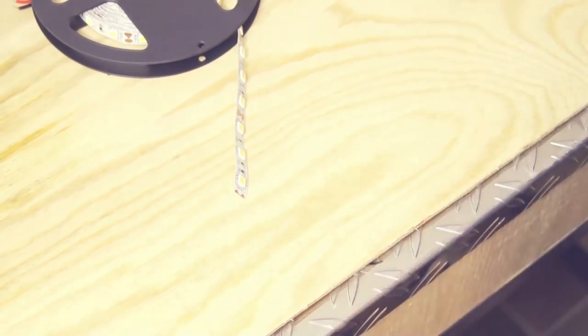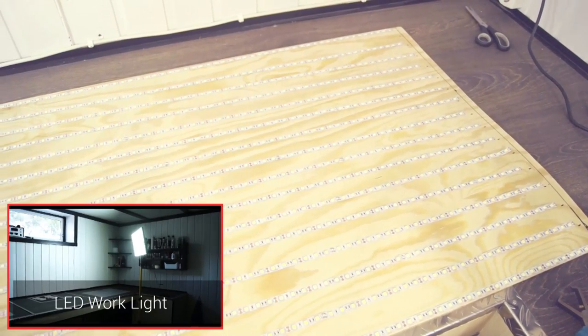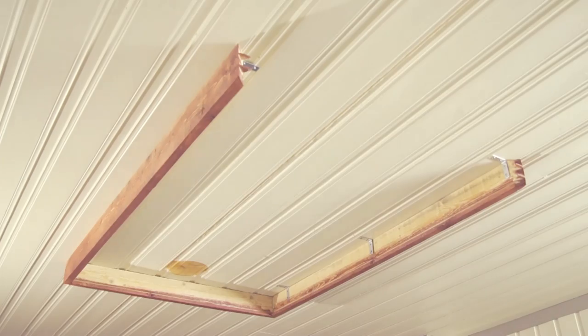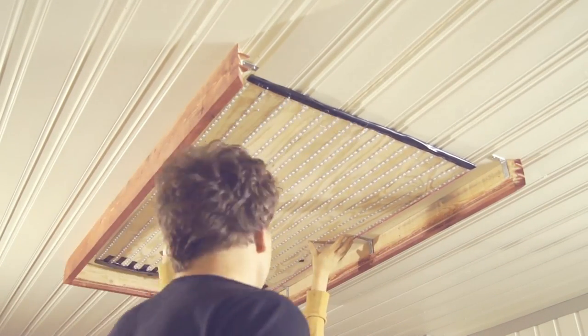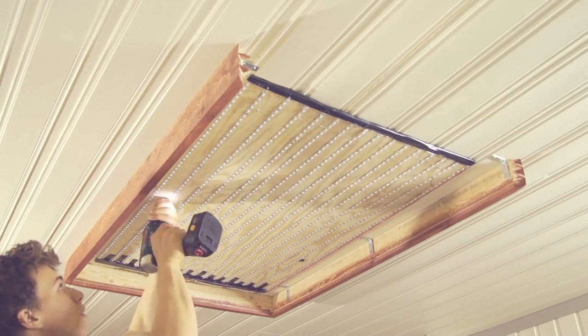So the next thing we need to do is to create the LED panel that will be the light source of this lamp. As we have an entire video dedicated to showing how an LED panel can be made, I will not be going through that now. But the rough specifications are: seven lengths of cold white and seven lengths of warm white LED strips, placed in between each other on a thin piece of plywood. I have a wooden ceiling so I could just use a couple of short screws to place it inside the frame. The power cable goes out on the back of the lamp and extends to a power supply on the wall. Now that the LED panel is mounted we can test the lamp — not exactly beautiful yet, but at least it works.